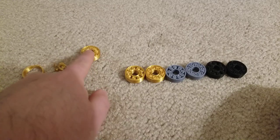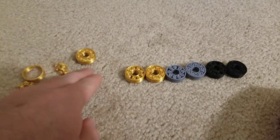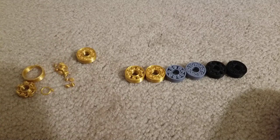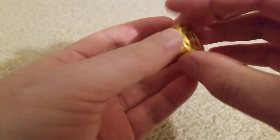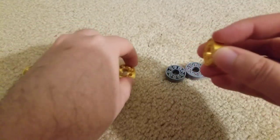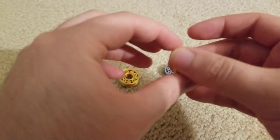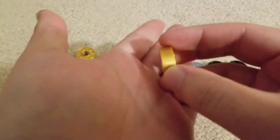That was at 0.2mm and it got stuck and didn't work. So I dropped the resolution to 0.1mm, figuring that might give me greater control — there's less material extruded per layer so maybe the tolerances would be better. And that was actually right, so these ones printed at 0.1mm worked pretty much right off. The gold PLA is a lot slicker than the other types I have, so I figured that would be good because maybe it has less friction between the sliding parts.